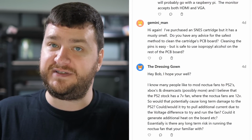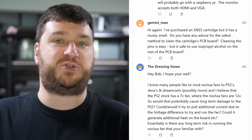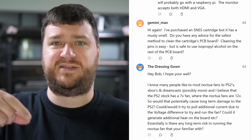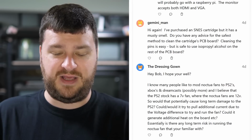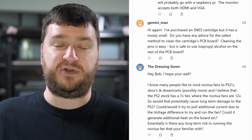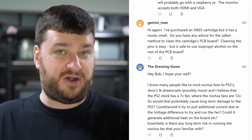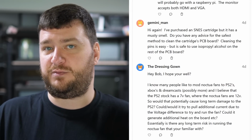And be careful, obviously, there are some components that are much more fragile than others. If you're scrubbing an IC with the thick pins that are through hole, go right ahead, scrub both sides. If it's really dirty, I might even pour a little bit more isopropyl over a second time to wash it off. And then I take compressed air to blow it all out.